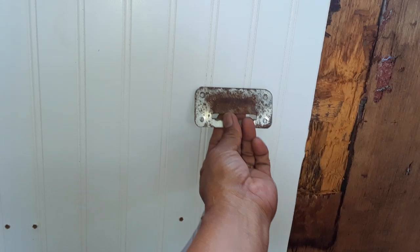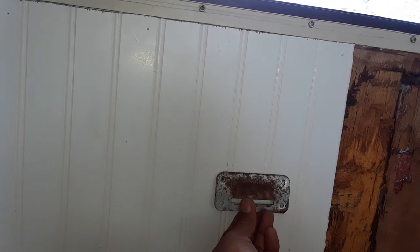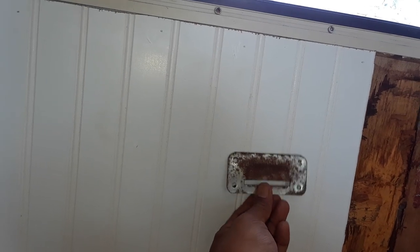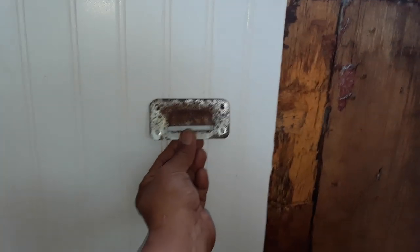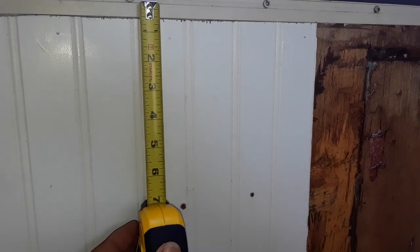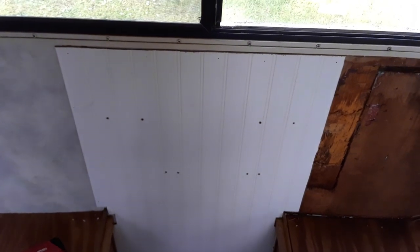Here then are the holes that we drilled as our guide — hopefully they'll be good enough. So we're going to put that there, and I'm going to double check to make sure that's six inches — make sure the holes that I drilled are the top holes. So I'm going to measure the height, the distance from there, and it should be about six inches or so if we did it correctly. Okay, I measured it and it's over seven inches. And what I realized when I looked at the template is the holes aren't exactly the top — there's like an extra inch right there. So it is at the right place — that is the top line where the hardware goes. So we're cool.